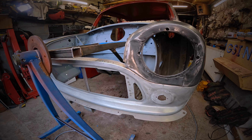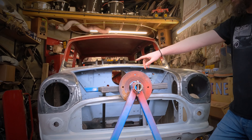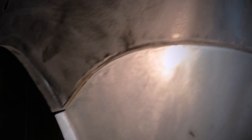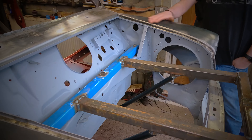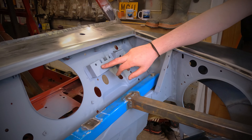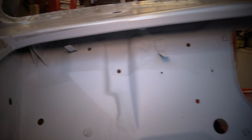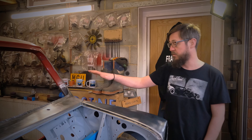The front end of the mini — this is probably what you haven't seen since the last video. We've now got wings on. We've replaced the inner wing on the driver's side because that was completely shot — you'll have seen in the first videos where there was a poor repair fully down the centre of that inner wing. That's all replaced now. We've got the front grille panel on as well. We've had to reinstall bits like the relay holder, as there was corrosion around and behind it, and the bonnet hinges in the top corners, and cable ties — we took those off, re-welded and put them on correctly.